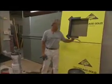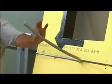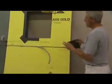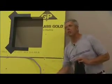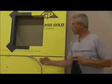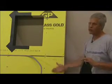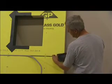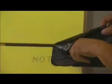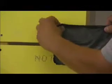Prior to doing any of your expansion joints, you actually have to fill the expansion joint with a backer rod. Normally, when we use that peel-and-stick membrane, this product can only be applied after your backstop material has been applied on the entire wall surface. You adhere about half of it on one side, then take your finger or the palm of your hand and tuck it in, then adhere it on the opposite side.